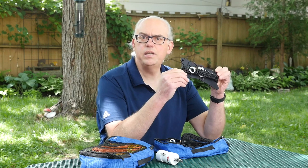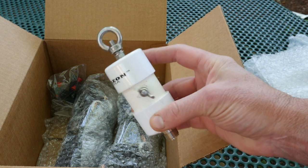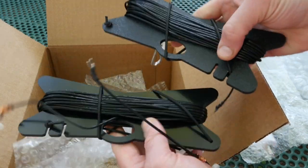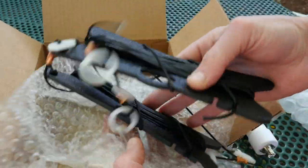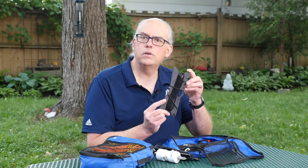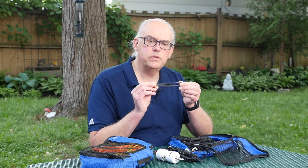Chameleon designed this to be a portable antenna, so the elements are made out of their 20-gauge Kevlar-clad PTFE wire, and it's stored on convenient wire winders. This is typical classic Chameleon construction. The 4020FD comes with the center connector, which is a one-to-one current balun, two elements of 33 feet each in copper-clad Kevlar PTFE wire, and two elements 17 feet in length each of the same wire material. All four elements are integrated on a plastic wire winder, and they also supply four rubber bongo ties.